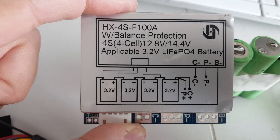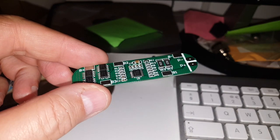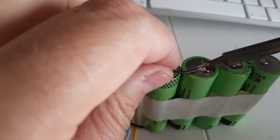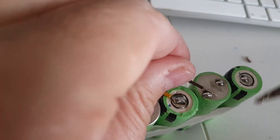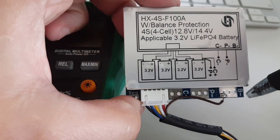I've made a mistake — I used the wrong battery management system. It's for LiFePO4 batteries, lithium iron phosphate, which is not what I'm using. I need lithium-ion batteries. You can see here the nominal voltage is 3.2V per cell on this BMS, but my cells are 3.7V per cell, so I have a problem. I have another BMS that should work, but I need to redo the pack — and that's not for this video.